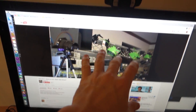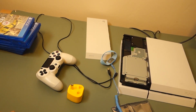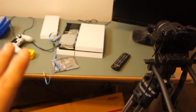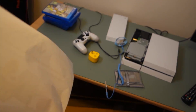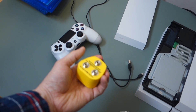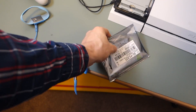You can probably see here — he's getting a spark and he's going to show the benefit of using an anti-static mat. Now this is an anti-static mat: it's conductive on the bottom but not on the top, and you'll see these four little clasps in the corners. They come in lots of different sizes. This one was apparently grey but they clearly sent a green-blue — I don't know what color that is. I got mine from a company called Elcom through Amazon. My friend Michael brought these over for me — you can see the wristband, a plug, and another wristband.